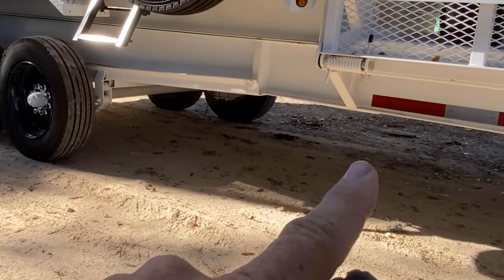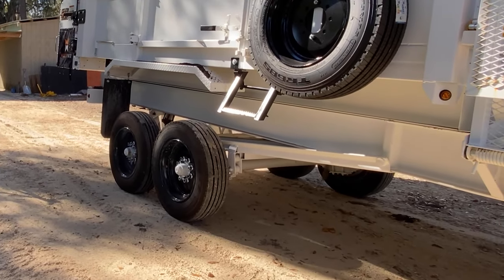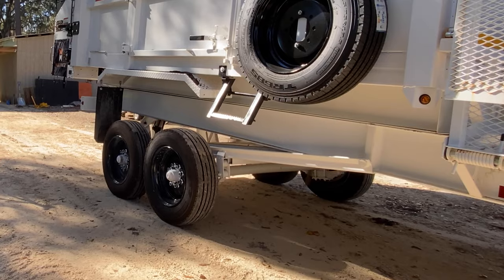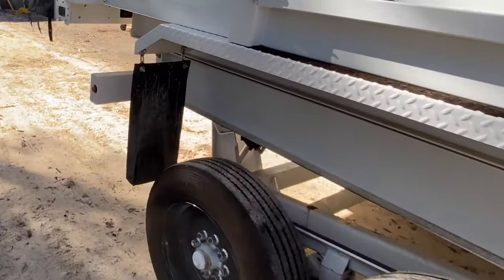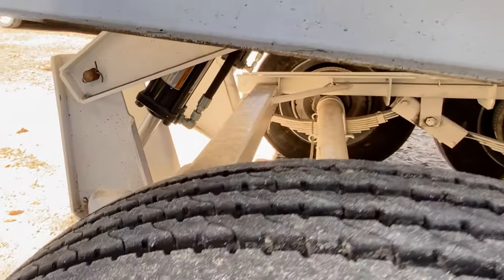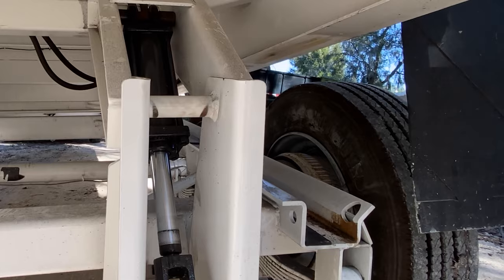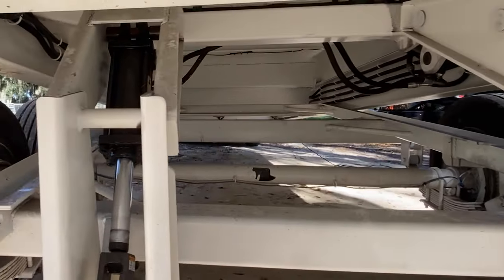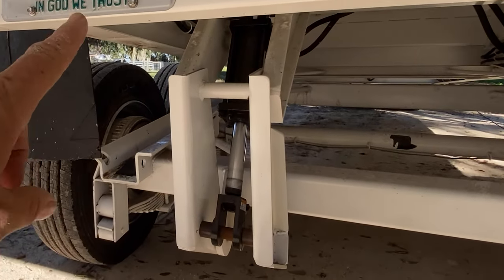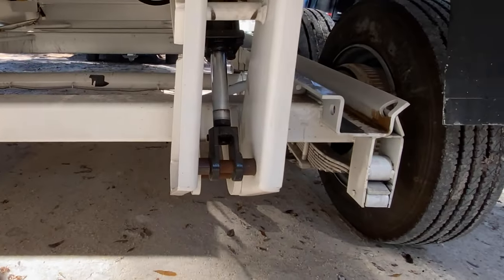See the pivot point right here — it's raising up the whole bed, pushing the dump bed and everything up. And there you go — it goes up 14 inches, maybe 16. The hydraulic cylinder is fully extended with all those crazy beefy linkages — you'll never bend this stuff, nothing to worry about at all. That's the rail I was talking about — it goes all the way up. It's a big lift, I have to say, it's a big lift.